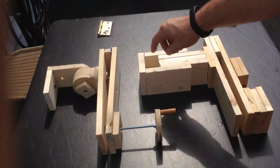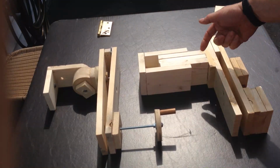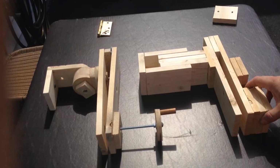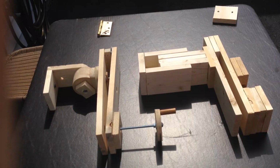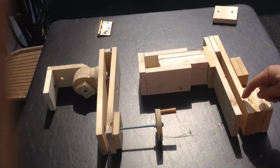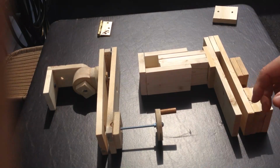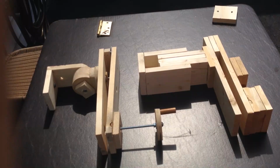This is the pivot point, the equivalent of this. This is the upright that'll be rounded. This. I wanted to do a double platform swing arm instead of the single. So that's this. I'm going to put these three pieces of wood here and put a T-nut on each side of them. What that'll do is allow the screw, the long screw, to go through this T-nut into that T-nut and give it more stability rather than having a single point to pivot on, because the 1/4-20 bolts and T-nuts don't fit really well. It's a really rough, loose fit. So going from T-nut to T-nut will provide some stability.